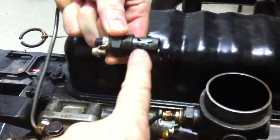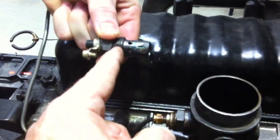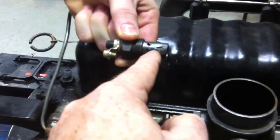Next we're going to look at thermal starts. A thermal start is a device that has a heater coil and an ignition coil, and it's supplied with fuel oil. When you pass electricity through the coils of wire they heat up, causing a ball valve to open — the fuel oil comes out, gets vaporized, and is ignited on the red hot coils. With a Lucas-type ignition switch, when you turn the ignition half against spring force it energizes the circuit. You can see the coil getting red hot — that's the thermal start device working.